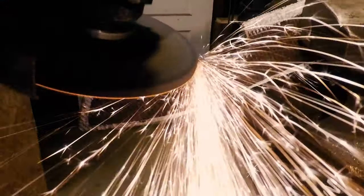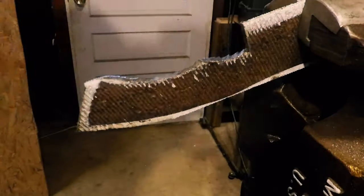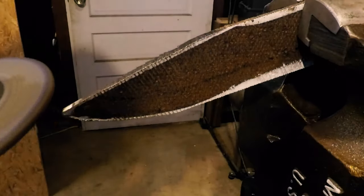Once the work shape is cut out with the cutoff wheel, we take it over to the grinding wheel and clean that up a little bit. After a couple of days of this, our belts do come in, which include a couple of low grit ceramic shredder belts from Combat Abrasives, and that makes the final shaping and profiling much easier, as you'll see here in a second.